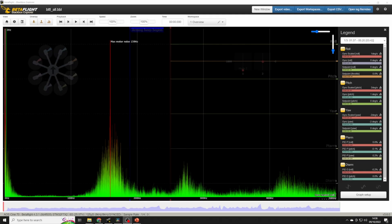Let's take a look at a blackbox log analysis to see how the Cine 80 performs from a vibration and resonance standpoint. Looking at the gyro-scaled log on the roll axis, the frame is incredibly quiet at low frequencies. One of the advantages of a low vibration frame is that you eliminate the need to run damping materials between the frame and your camera mount — no alpha gel dampers, no silicon dampers — making the whole frame more rigid and effectively eliminating the low-frequency payload vibrations that typically plague most Cine Lifters. There are no resonances at all until we start seeing motor noise.